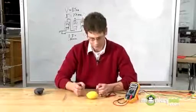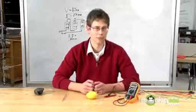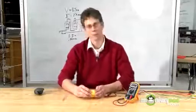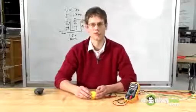If we remember from our first lecture, the battery required in order to illuminate an LED needs to produce 1.5 volts and about 10 milliamps of current. What we have now is a battery that's producing about 0.9 volts, so theoretically we should be able to put two batteries in series in order to increase the voltage high enough to drive an LED.